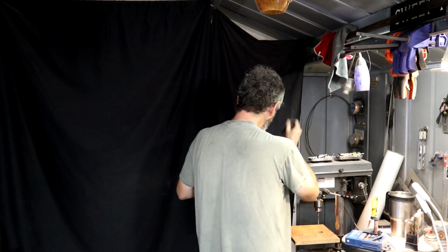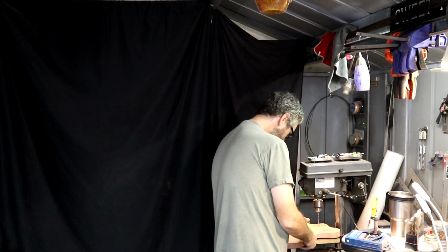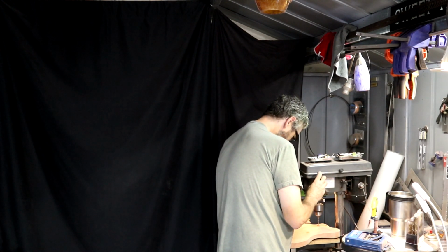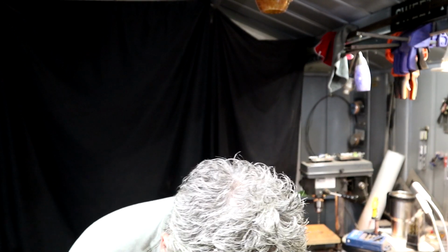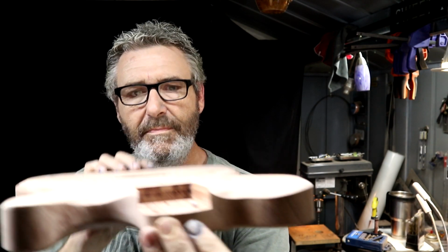The one cool thing about a twist drill bit is it will find that indention that the brad point left. All right, so let's check and make sure our 5mm bolt's going to go through this hole. So my measurements were correct when I ordered these bolts, and that gives me a good 5mm up into the insert to make sure that I'm getting good contact.